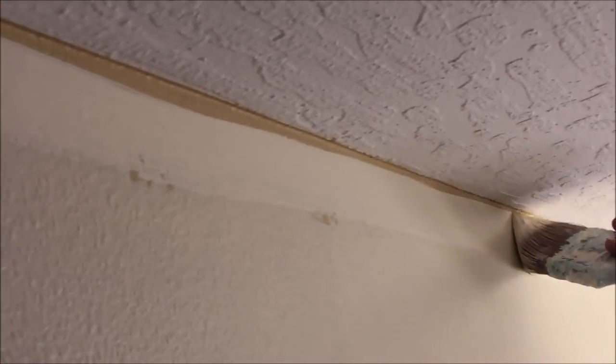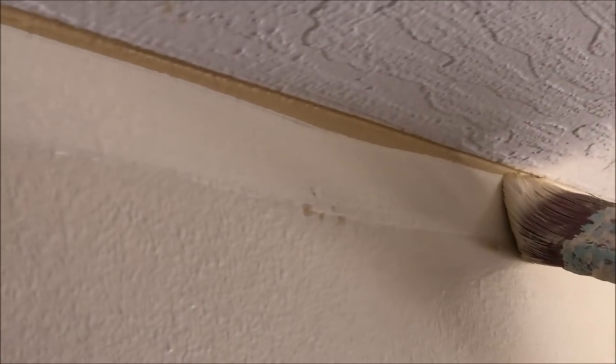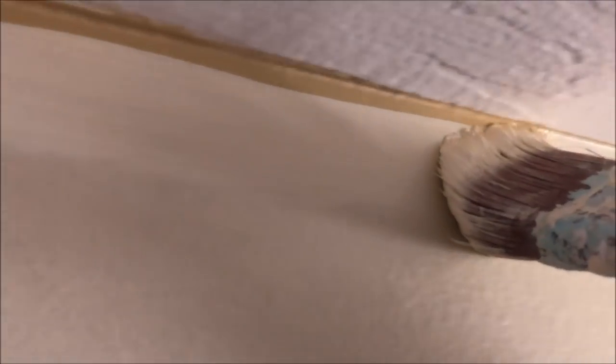Come back that opposite direction but not flipping the brush. I will be touching up the ceiling where the previous painter got the dark paint on it. I do this flat brush method at the end just so I can leave a good amount of paint at the cut in for better coverage.